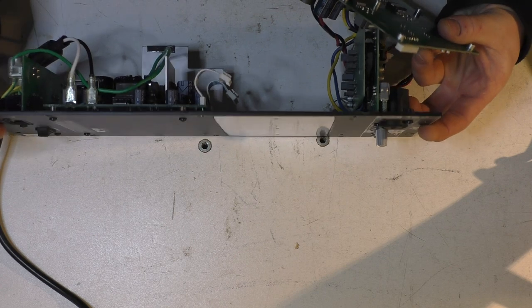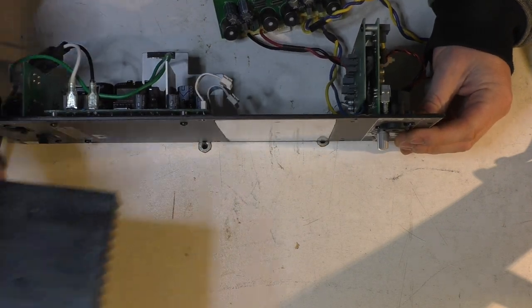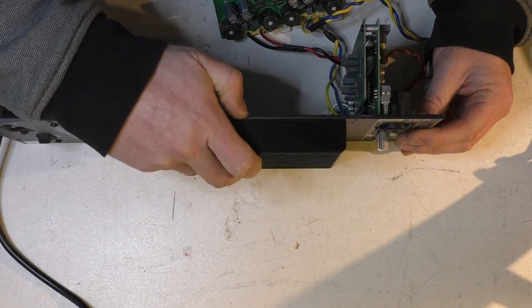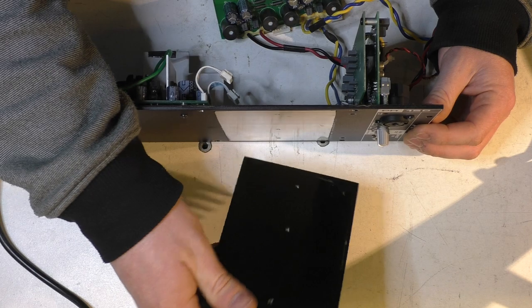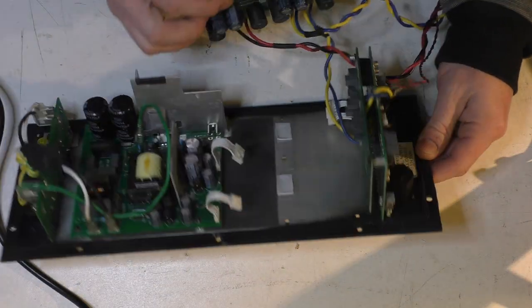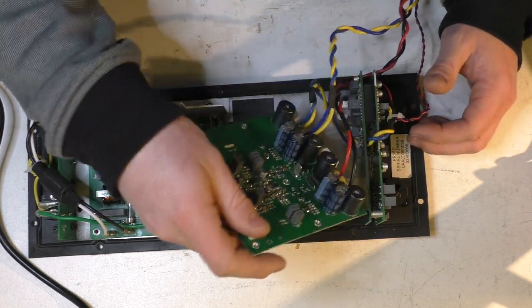So all the figures these chips are rated at only apply with perfect heat dissipation per the datasheet guidelines. These guys have it going through a rubber pad, through the chassis — just three-mil aluminium — then smear some heat transfer compound on there and clamp it. That's two, really three, interface layers, and it's a really inefficient way of dissipating heat. That's probably why it's blowing up — one part goes short and it blows the living daylights out of everything attached to it.